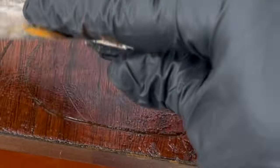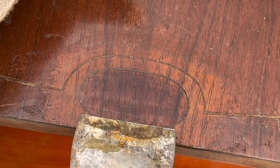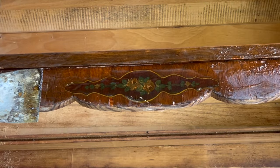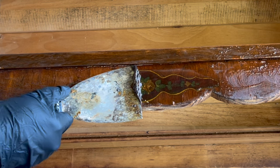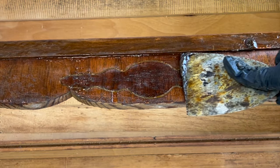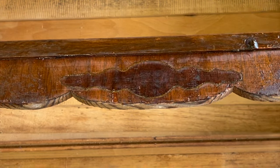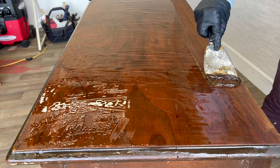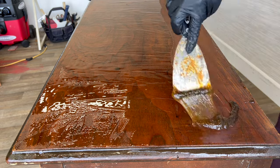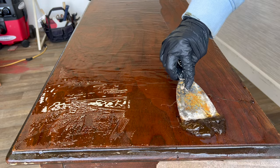So this is the safe way to deal with lead paint. You want to strip it with a product that is made to deal with it. This gel encapsulates the lead, preventing any airborne particles. Actually, this company, Franmar, has another lead paint stripper that has an additive in it that will change lead into a non-hazardous compound. I think I need to get some of that.